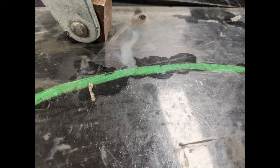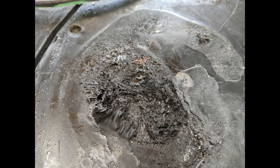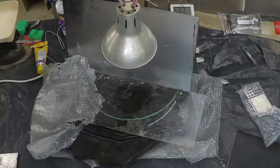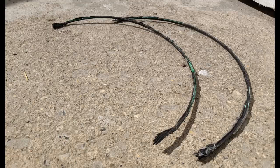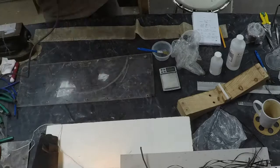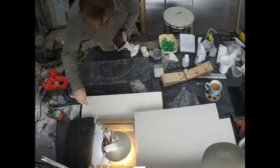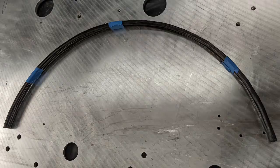As I mentioned, I didn't allow myself quite enough time for all the cure cycles — the slow resin can take 30 hours to cure, and I wanted to be able to work on it again first thing the next day. So I put it under a heat lamp because cure time is significantly speeded up with a little bit of heat. When I came back the next day though, I found I'd been a bit keen with the heat lamp and the HDPE had melted. The arches demoulded okay but came out warped, which is a problem for structural integrity, and they were also underweight. To fix both issues I added extra wraps of carbon fibre tow in alternating left-hand and right-hand helixes, then compressed them with heat shrink and clamped them flat for curing.